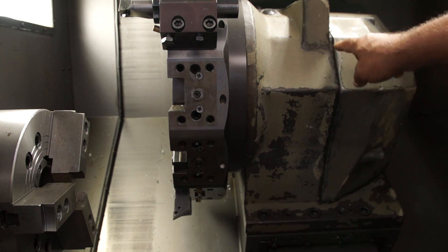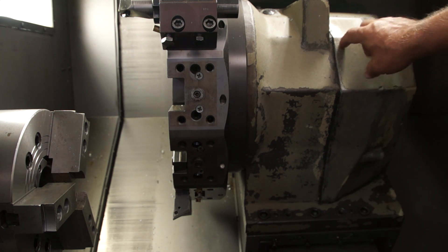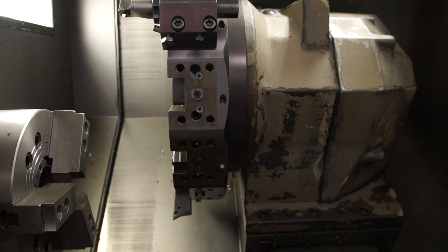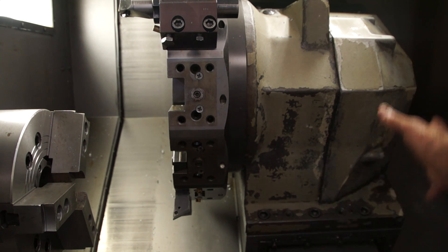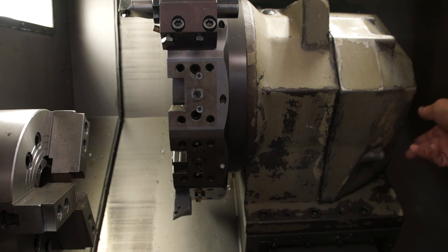Then after you've done that, you're going to take a razor blade, take all of that gasket material and scrape it off, clean that surface with acetone, let it dry, reinstall a film of non-hardening automotive gasket material, and remount the turret cover plate with these long allen bolts.